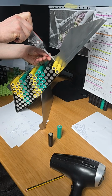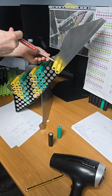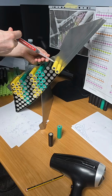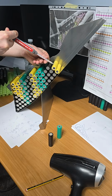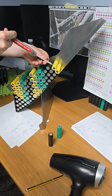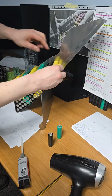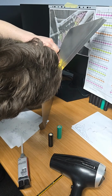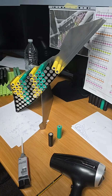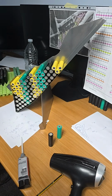Okay, we're going to put this on here now and turn it downhill again. This is coming to an end. So I want this bead about 3 mil wide, nice and straight. I'm happy with that one. Try not to get it on any other part of the cell. And turn it downhill into string number 7. Perfect. So I can now place the next cell in, which is going to be yellow, and I can finish off this string in a minute.